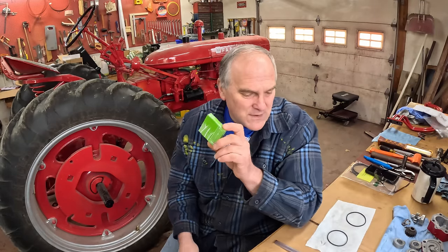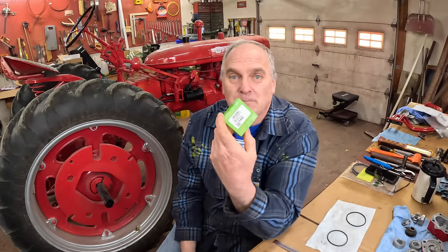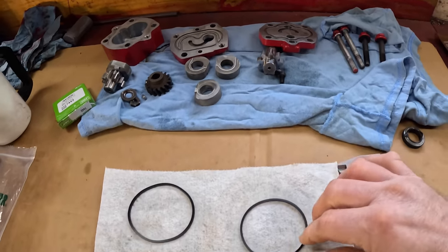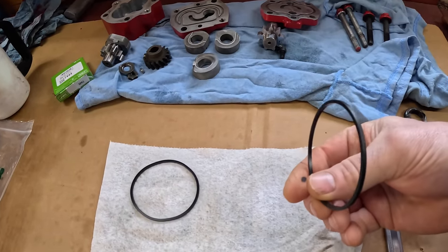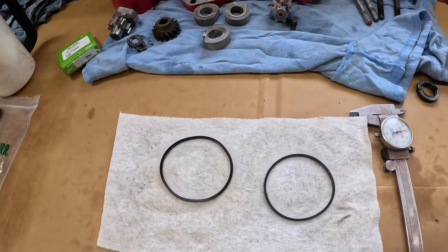in dealer inventory online. So I went down to my local NAPA and I cross-referenced the old seal, which was a Chicago Rawhide lip seal, cross-referenced that number to an SKF seal. NAPA had one on the shelf, SKF 7443 for this pump. Here are the pump parts. I've cleaned everything up, and the holdup really was on these O-rings, which are square profile O-rings. There's one in each cover of the pump. They're a different size. They're large square O-rings though, hard to find.